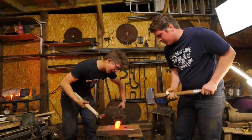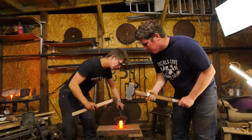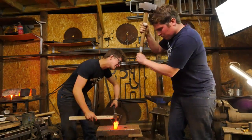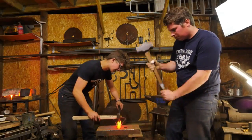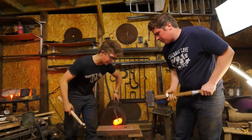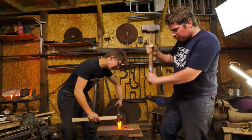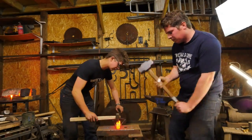So this is my hammer eye punch. It's not a punch really suitable for making an axe, so it's going to mean that I've got to fanny around a little more than I like when we're drifting. Okay, and now we'll go hard. Now we're a quarter of an inch deep. Very nice. I take the punch out every time. Beautiful, striking.